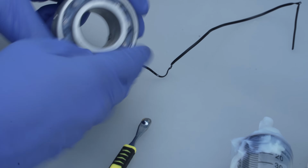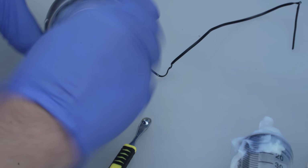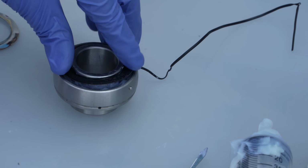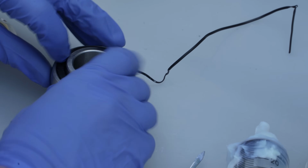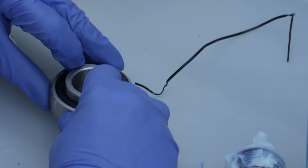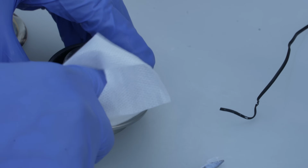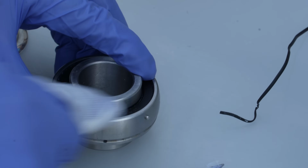We can now go about reassembling our sealed bearing insert. Nice clean seal, of course. There's a slight mark on it that shows where I prized it off, but certainly no damage that I'm worried about. Remember that these will mostly operate, for me, at super low RPM and in the cold, so conditions least likely to leak grease. It's not obvious exactly how far to push the seal down, so I just used common sense and made sure that it was uniformly seated, then cleaned up any smears.